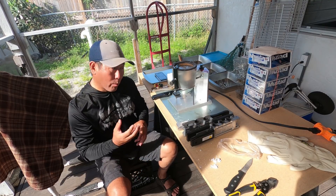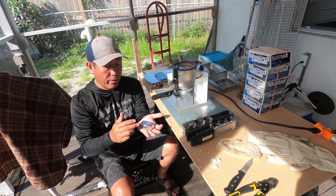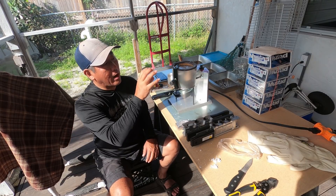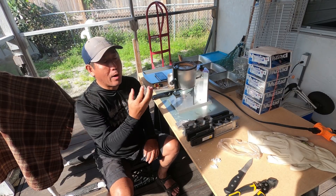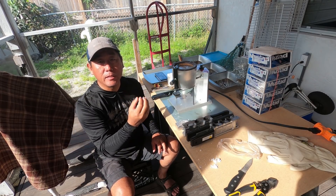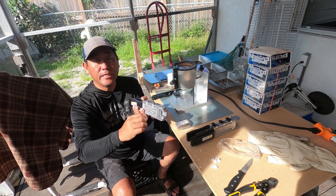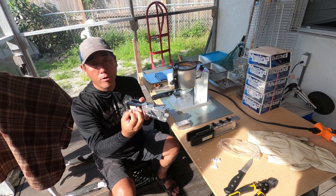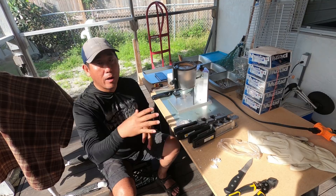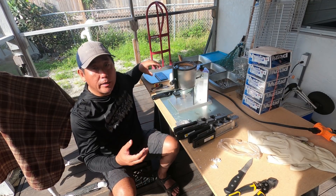The lead is finished melting. Our next step is to clean that lead — or flux it, as they call it. I use these lead ingots which have been properly cleaned before being poured into the ingots, however there are still going to be contaminants I want to remove, as well as contaminants from my last pour and oxidation that occurred while it's been sitting. The main purpose is to protect our nozzle from any blockages, because if it gets blocked you won't get a good flow into your mold and you'll miss fine detail portions or the lead will harden too quickly from not streaming fast enough, leaving a very uneven pour.